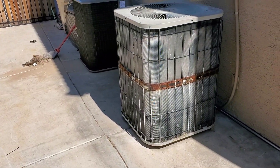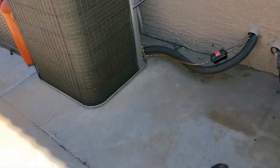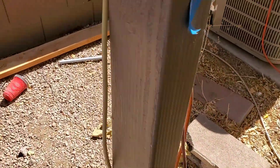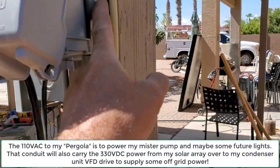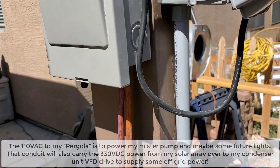Outside is pretty much wrapped up. The Goodman unit next to it is running — pretty loud by comparison. We're not ready to tie in the solar yet; the conduit was being run today and stopped right there by the pull box, courtesy of my electrician friend. I'm also tapping off 120-volt to feed this little box here. The 110V was temporarily fed through an extension cord, but we'll pull proper power for the 110 and also pull the DC power coming out of the solar through there.